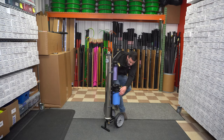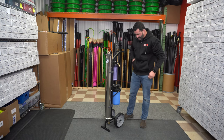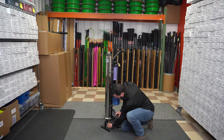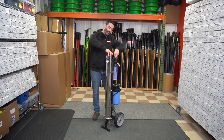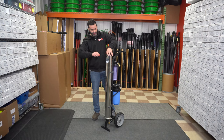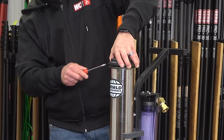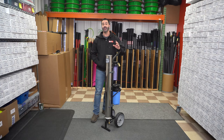Next, connect back to your DI and have a brass cap — put this brass cap on the waste. Then you're going to open the top cap on the RO housing. They are on there pretty tight, so what you can do — you're not going to hurt it — just take a flathead screwdriver and just kind of slowly work it. Be careful, don't jam it in there. You don't want to damage the o-ring in there. Caps off, set it to the side.